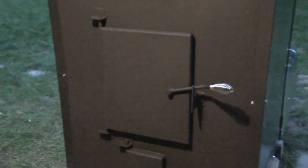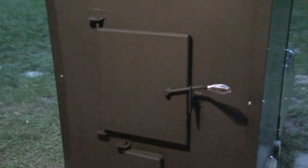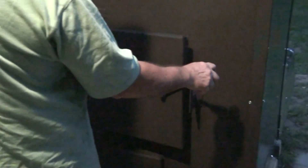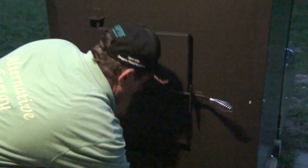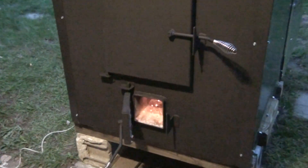This is about a two-hour process but it can get pretty boring just running a video, so I wanted to show you we've got a fire going in here. It's pretty clean burning inside there. When you open the door, you want to pause at this stage — that helps increase the draft so any smoke will go out the stack, not come out towards you. Right now if you look down in the ash drawer, you can see we've got coals working their way down there, and that whole unit is creating heat.